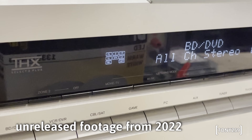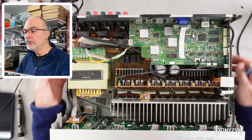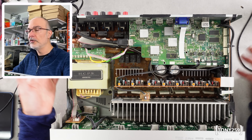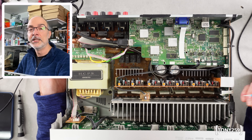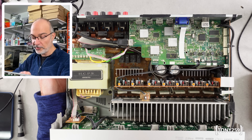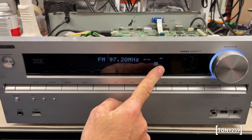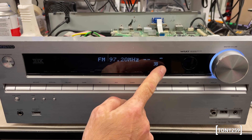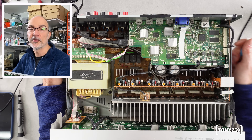I kept this receiver working here in my workshop for a while, but about a couple of weeks later I moved it from my bench to the floor and it died — it wouldn't turn on with sound anymore. There's no sound coming out, you see the no-sound pictogram, the speaker pictograms at the front of the display, there's no click that should enable all the final outputs, and that told me that the IC again was responsible.